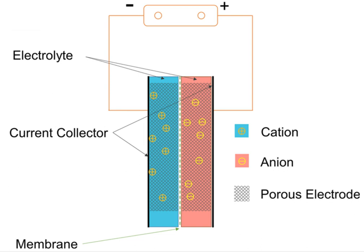Topic: Activated carbon. Activated carbon (AC) was the first material chosen for EDLC electrodes. Even though its electrical conductivity is approximately 0.003% that of metals (1,250 to 2,000 S/m), it is sufficient for supercapacitors. Activated carbon is an extremely porous form of carbon with a high specific surface area.